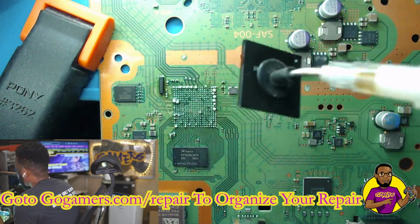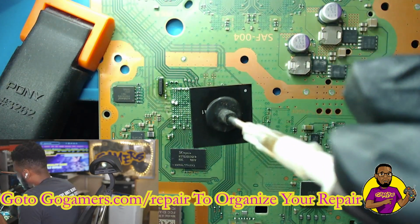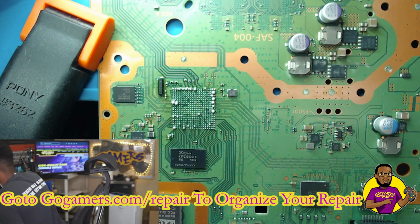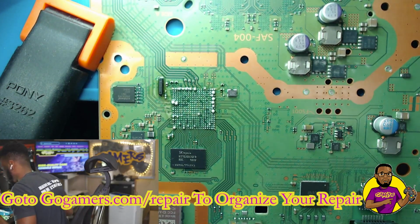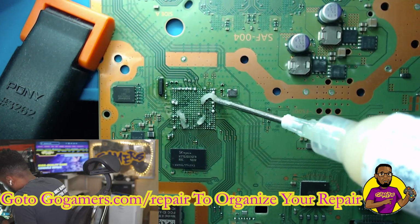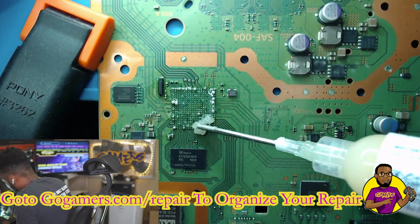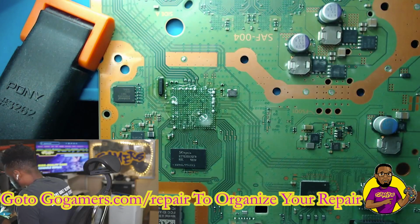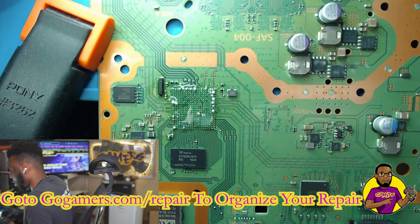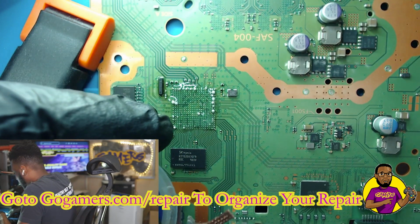All right, so as you can see, we got it lifted off the board. And now I am going to set that Southbridge aside, get that out of the way. Now we're going to apply a little bit more flux, and we're going to heat up our Hakko solder iron. I'm going to max it out as well. And I like to pre-cut strips of desolder braid.